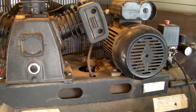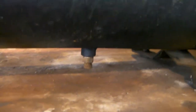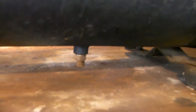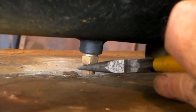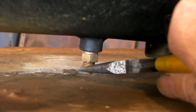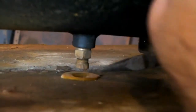So we'll go down to the valve now. Once again, go down to the very bottom of your compressor — it doesn't matter what compressor you've got, it's going to be right at the bottom of your tank. That's where the valve's going to be. So there's the valve — get your pliers or whatever you're going to use and undo it. This one hasn't got a hex on it so it's just a finger-tight thing. As you can see it's starting to come out — it might pay to put your earmuffs on when you do this.